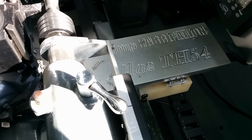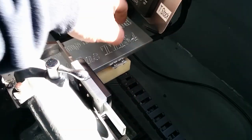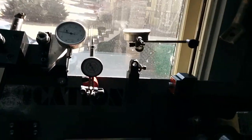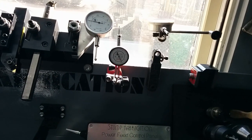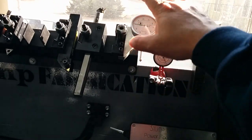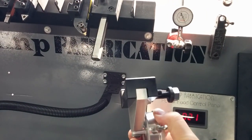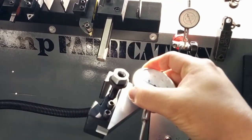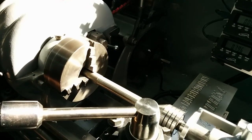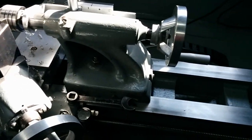The plate hides the scale and keeps the ways nice and clean and keeps all the chips out of the lead screw. It also — if it was steel, it'd be great because I could use it for mounting a mag base for an indicator, but I didn't really think that through, so it's aluminum. It looks nice though. Anyway, I usually use this indicator holder instead — I just made this holder on the tool holder here, threw that together, and the indicator mounts to it. I got the center height adjusted so I can indicate pretty much any standard rod in the lathe really easily just by throwing it in the tool holder.